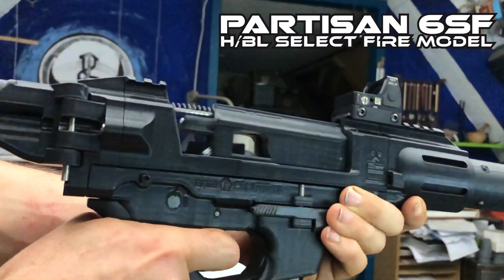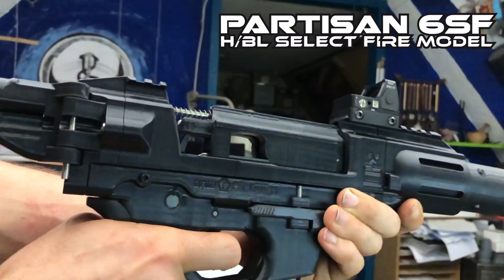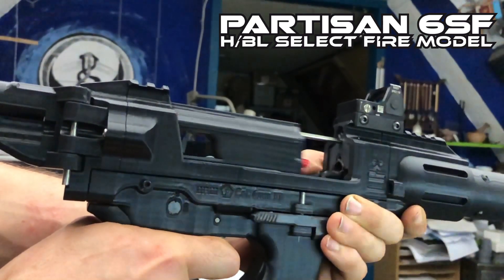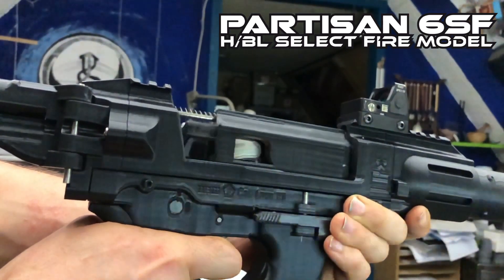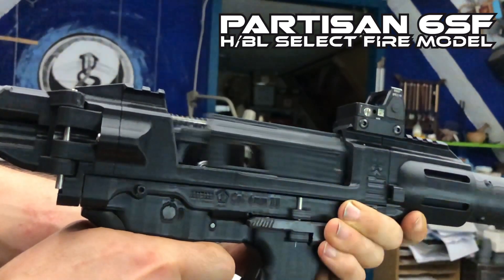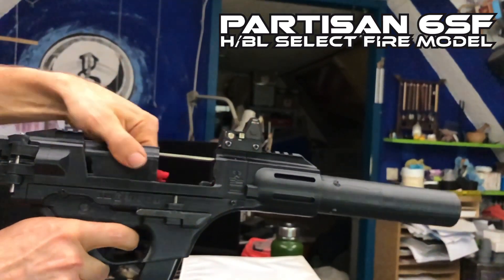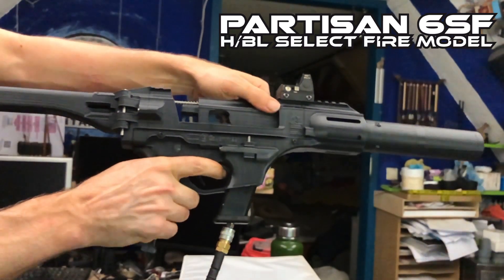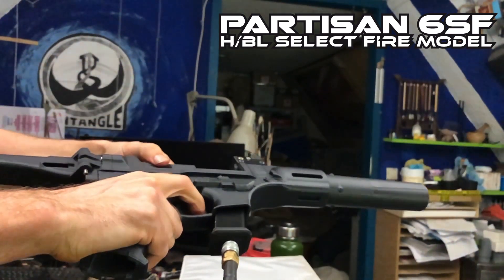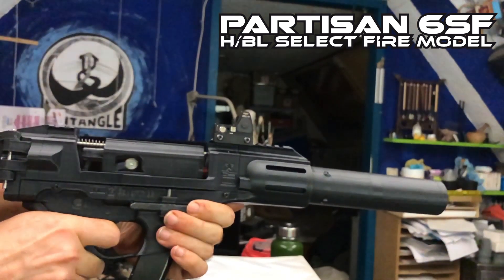When the bolt is going forward, that is the moment you want to focus on — is the bolt bouncing open again or not? Also, if you notice that your fire rate is inconsistent, that is a clear indication that your anti-bolt bounce is not working correctly. This will also give you inconsistent FPS. Those signs give you a clue that it's not built correctly yet, but it can be hard to spot if you're using short bursts and getting lucky. So that's why this is important — here's a clear example of a bolt that is bouncing.